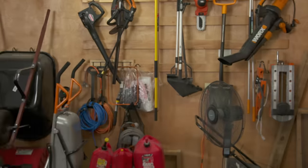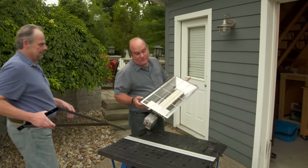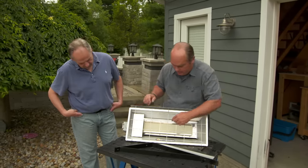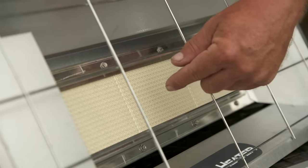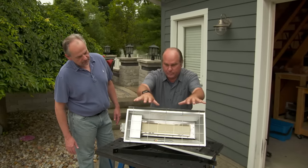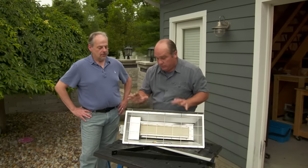What if I could get you something that didn't move the air at all? That'd be great. Here's how we're going to heat your garage slash workshop. This is a gas-fired infrared heater — a radiant heater. It has a gas valve right here. You can see there's a ceramic element right here, and this will glow and get really warm. This heater heats objects. We've seen these in commercial warehouses, restaurants, outdoor cafes. You also know radiant heating from the sun — stand outside on a cold day in the shade of a tree, step out and you feel more comfortable because those rays are absorbed by you. We want to do the same thing here. This has an aperture, and anything in its path is going to absorb energy — that means you, the table saw, any object. So we've got to think about where we place it.